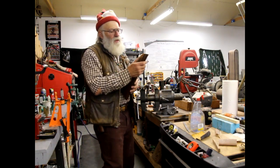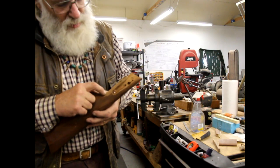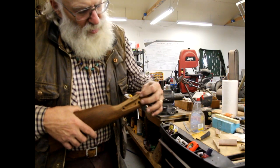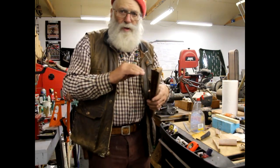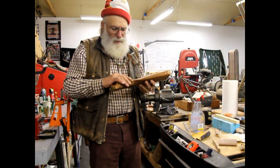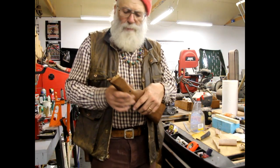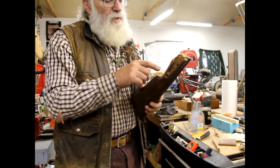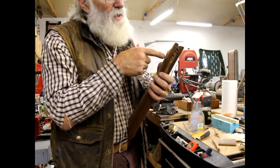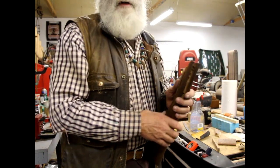I've been working on this stock and I'm to the point — it was cracked here and it cracked up into this mortise and all the way down into this other mortise. When I went to try to stick a little glue in there to squish it back together it just popped off, so the first thing I had to do was glue it and clamp it. Now you can see where my first nail is — right there at the top of my finger. That's a little piece of oak dowel. That one went in between this hole, mortise, and this hole. Now I've got to drill one kind of angled this way so it misses this mortise, misses this mortise, and misses this hole.